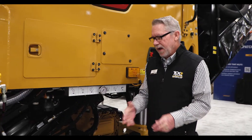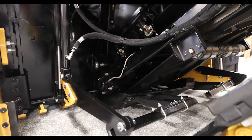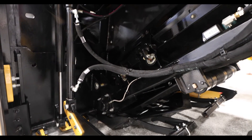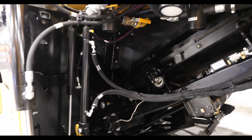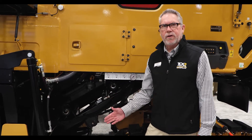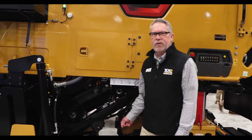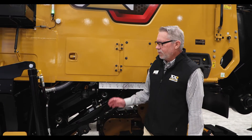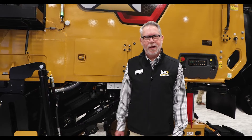The other thing I want to go over is right here with our anti-slab device — we changed the whole structure of this. As you can see, new wear bar options, whole new configuration. So when the side plate is rendered useless, we can drop that inboard ski and use that for grade control. That's a very important part because without grade on these machines, you don't have too much.